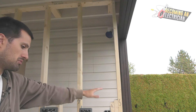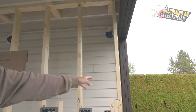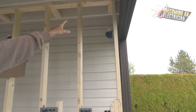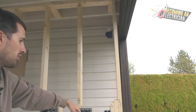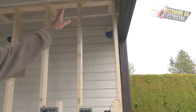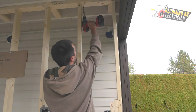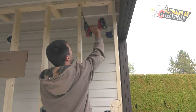A lot of times near a door you could have a baseboard heater and a thermostat — so that's another wire. That could be coming down and going somewhere else, so I'm going to pop two holes there because I'm for sure going to use one, but I'll probably use another one too. If there was a thermostat, we also have a double gang here — let's say two switches — so let's just go with two holes up top. When drilling, you don't want to put it too far out in the middle, and you also don't want it super close. Just a little bit out, and then when it comes in, you can staple it in nice.